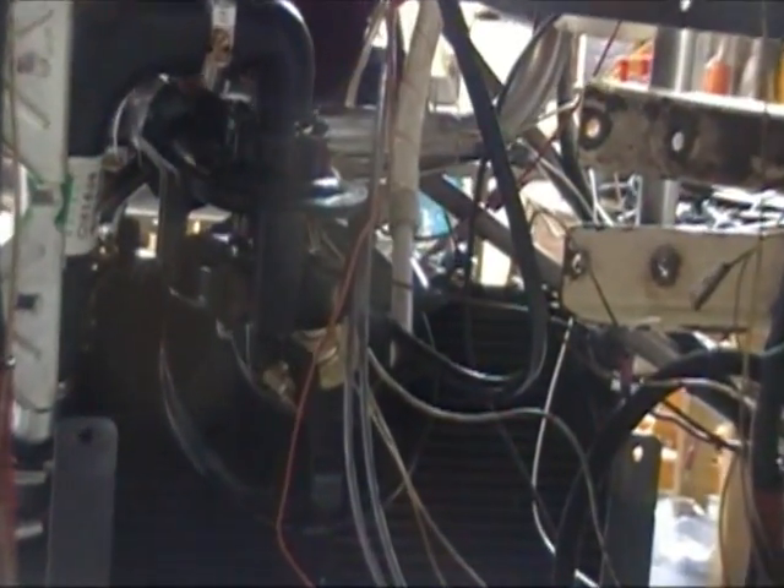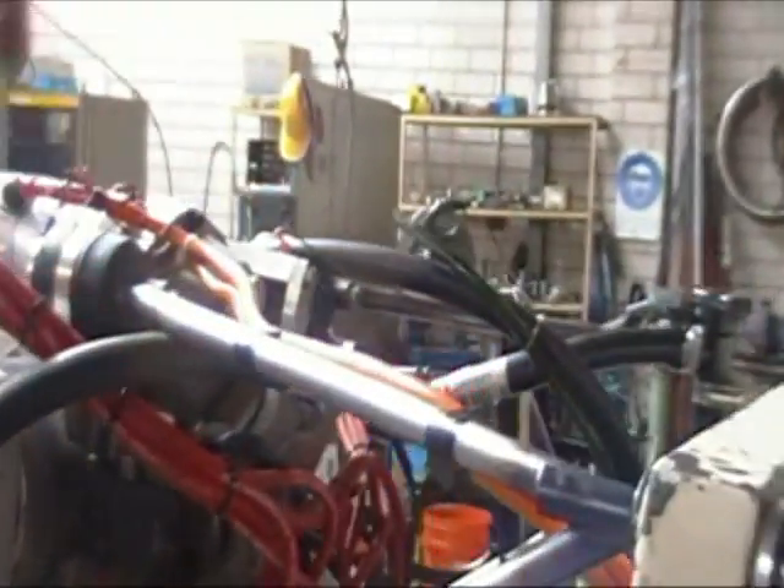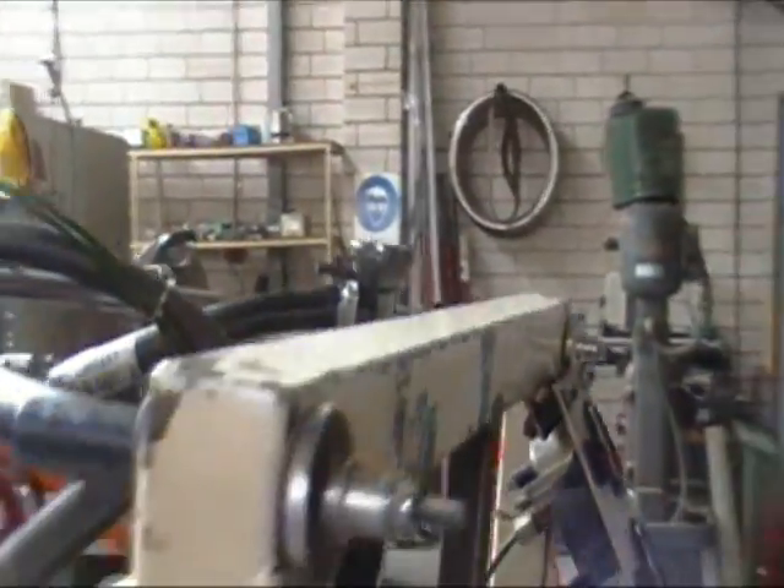For the convenience of the test rig, it's just suspended between the hoses. This hose is picking up the cold water from the base of the radiator, feeding the inlet. There's a centrifugal vane-type pump in here, and that pushes the water out to this spider manifold. We've got three lines off each side of that manifold feeding the three individual heads on each bank. Once the water goes through the heads, we pick up off this common rail, join that common rail together with the other side, and then go back down to the top of the radiator for cooling. So it's all quite nice and neat.